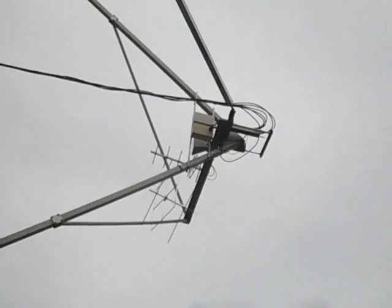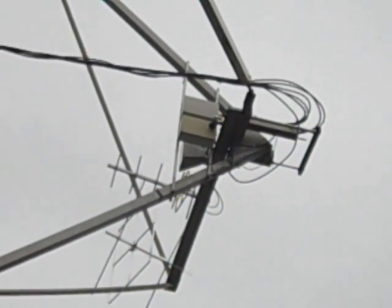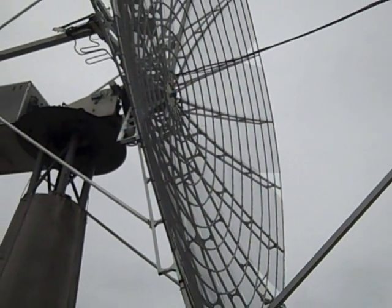So it's basically just to have, because as you send the radio signals, they will go in all directions. And if you can see the small antennas, they have the area they cover, which is small. But if we use the parabolic reflector, we collect much more energy and focus it down to the small antennas, just like an optical telescope does with a mirror. So it's just a mirror which collects the radio waves and focuses on the smaller antennas.